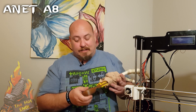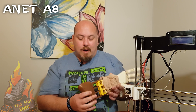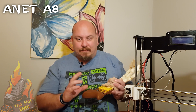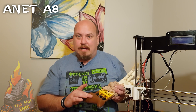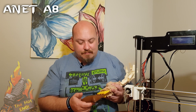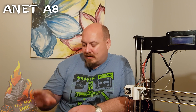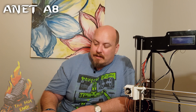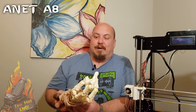This has only got about 10% infill. My settings I tend to use are five bottom layers, ten top layers, and three perimeters — that's on the 0.4mm nozzle. It really depends on the output I'm hoping for, but I didn't need any better than that, so that's how I set it up. A fun little print.